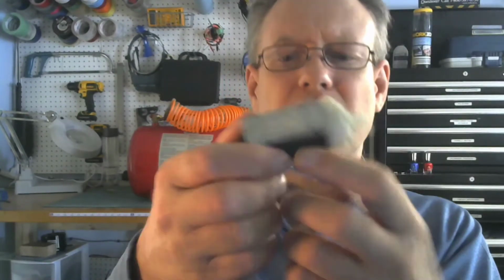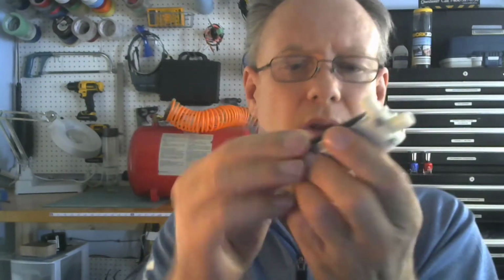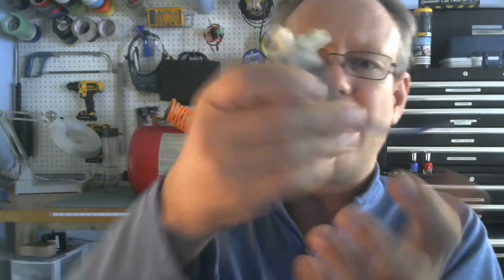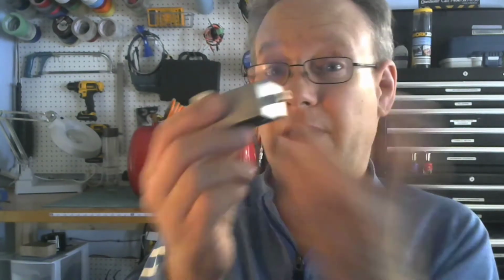What's going to happen is that this can be used to change the state of a valve. I've got a solenoid valve here. You can see this is a big coil in here. This is a really powerful thing. There's some kind of activation in here, or a spool of some type, that's going to move and change the state of this valve. That's a pretty heavy solenoid valve, and it has an exhaust coming out here.